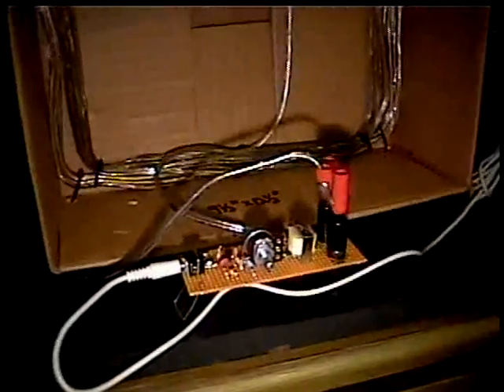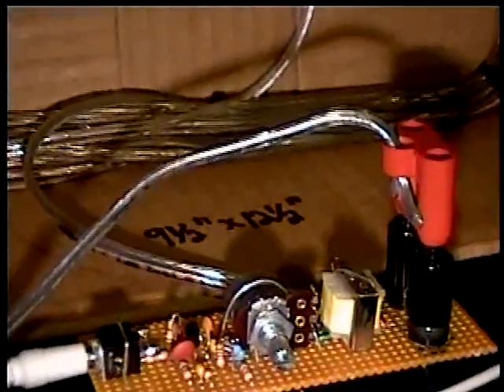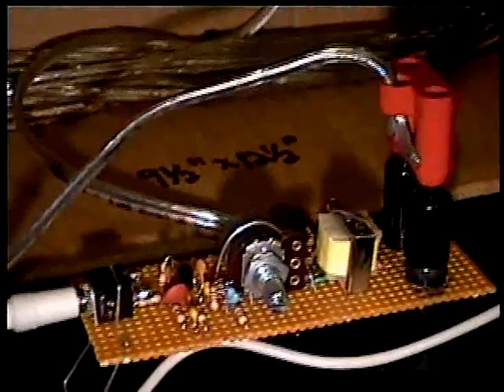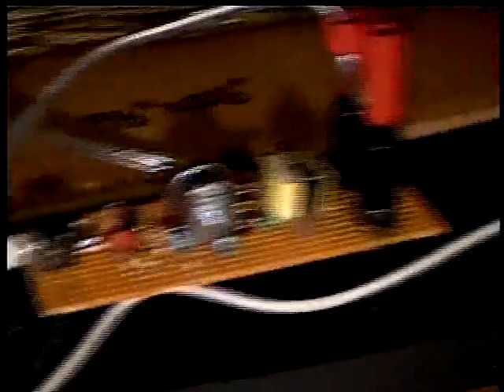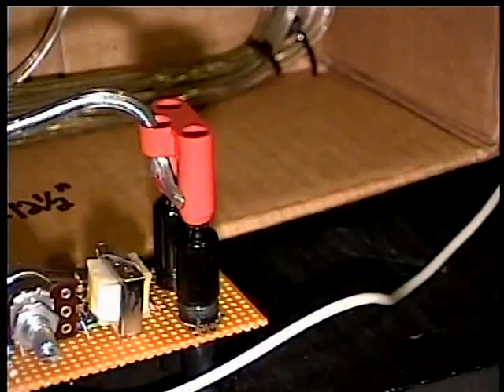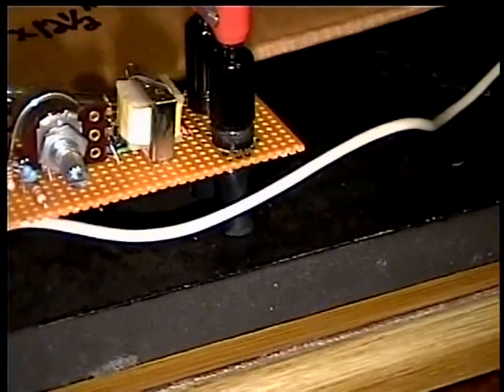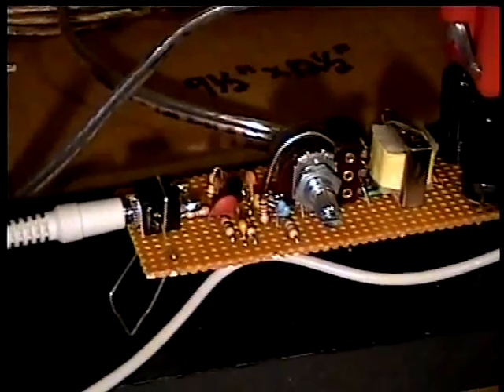Swing the camera back — it's just sitting on the tripod and I have to kind of finagle it in there to get a good close look. We'll zoom back in on the board — and that's pretty much it. I use paper clips for the substantial wire parts, like to brace the output jack and hold the loop load control. We have just a pair of typical five-way banana post type jacks here. Since they protrude on the bottom they're wound with electrical tape to prevent shorting on a metal surface. It forms one side of the support, and some paper clip wire forms the other side.